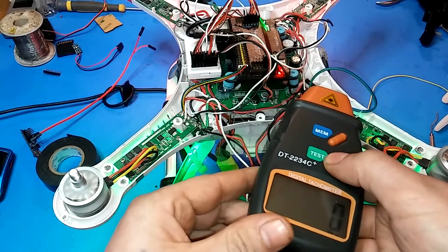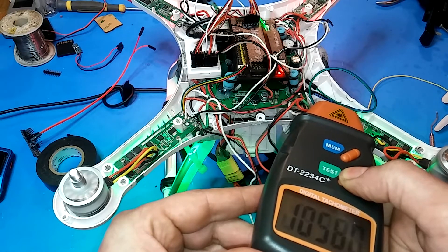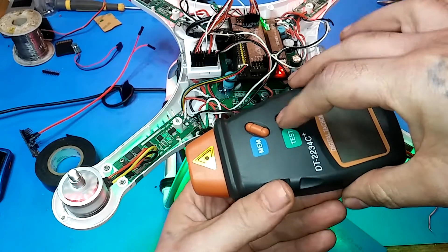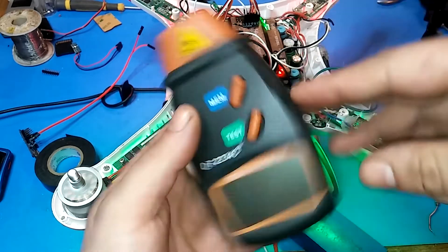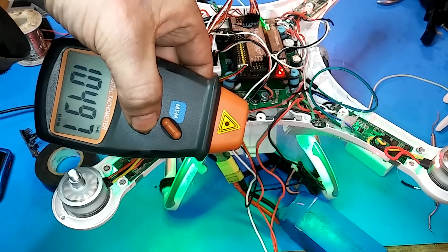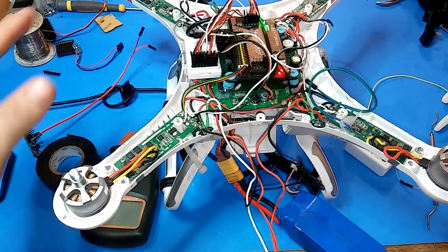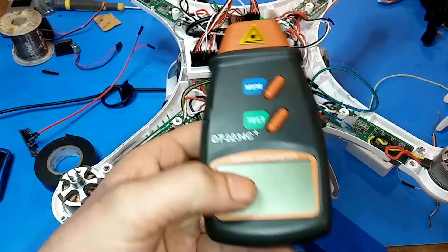Not sure if you can see it, but readings are around 105 - not bad, but it should be about 110. If you're getting less than 104, that might be a sign of trouble. They're all pretty much reading the same, all sticking around 104, and we wanted about 110. That's the first sign there's something wrong with the motors.